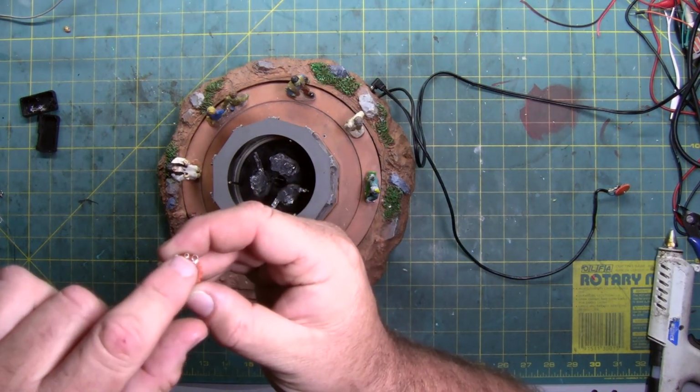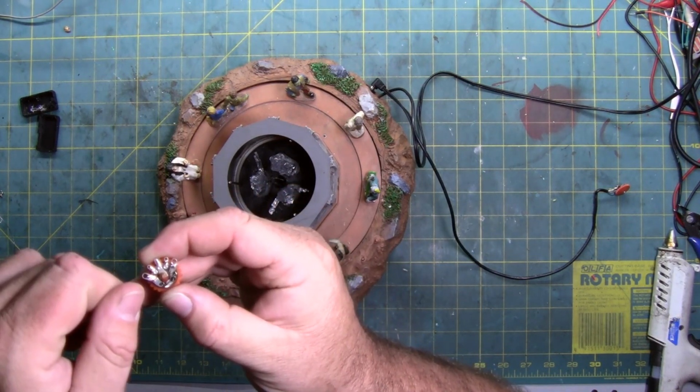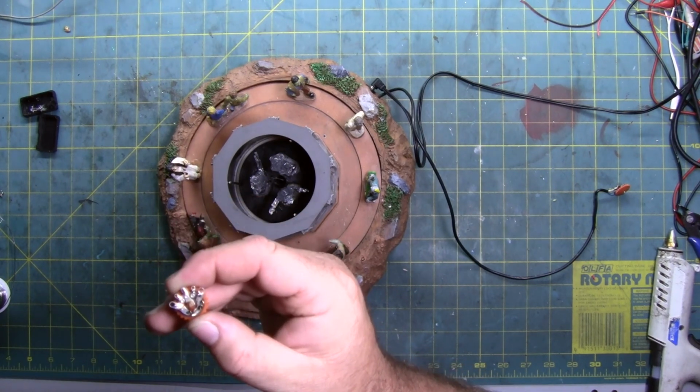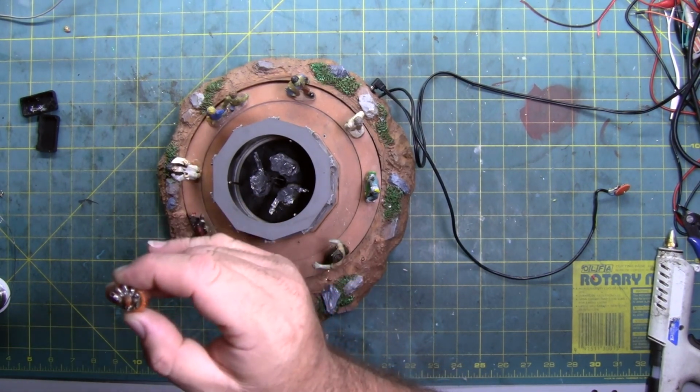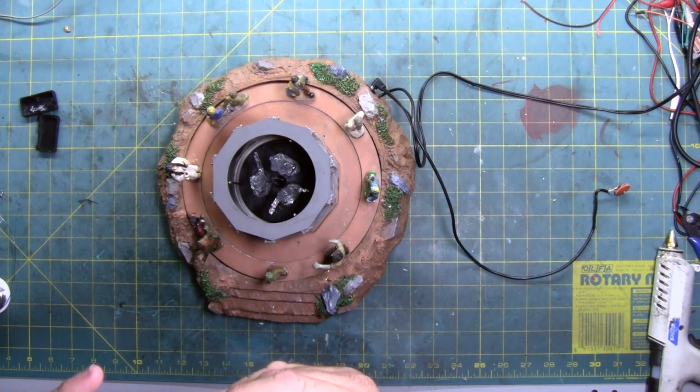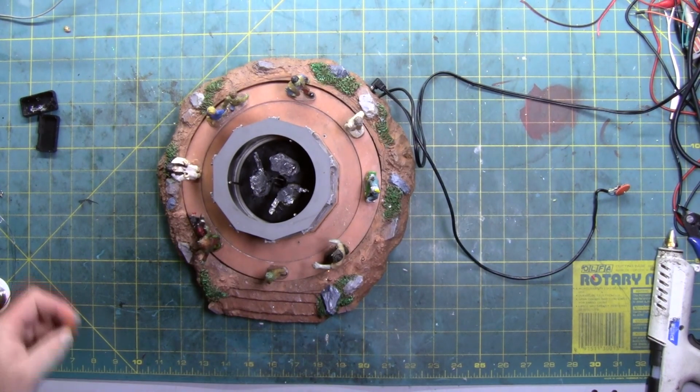And you add a little solder to the tops of them, then you heat that new solder and pull the wires off. You can then use a solder sucker to clean the pads of your new switch, as an example, or solder wick. I would not recommend using solder that is lead-free because your adhesion won't be as good. You have to get it hotter in most cases, and it corrodes and cracks faster than lead.